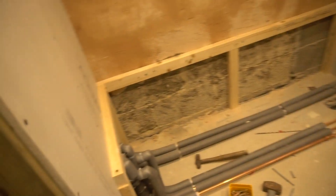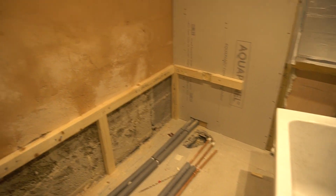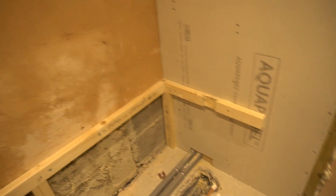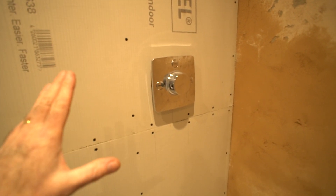Here's the progress we've made so far: all the pipework is in, I've got everything boxed in at both ends. The bath just came with a few brackets to go on the wall, but I've put batons along the walls reinforced in the corners made out of CLS so it's definitely not going to move. Obviously if the bath moves the silicone can come away at the edges. I've fitted the overflow — this is a little bit tricky because it has a push-fit pipe, so I've bent a pipe to bring that down and around, then I'll put a flexi pipe on the floor to connect to the waste. I'm going to glue and slide the panel on the wall, check the fit, then glue it with some adhesive into the wall and run silicone sealant around it before we install the wall boards.